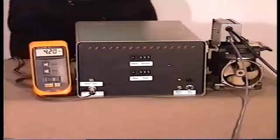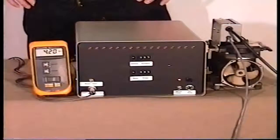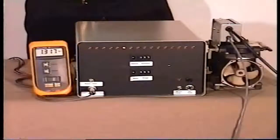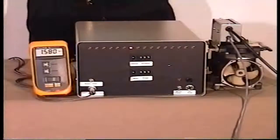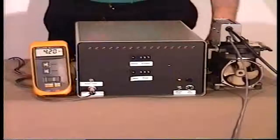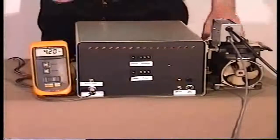The sequencer is also useful in your system if you're dealing with some corrosives. This can go on the back side of an analyzer where your analyzer would continuously measure methane, carbon dioxide, oxygen, and hydrogen if you have a hydrogen sensor. Then you can feed the output of the analyzer into the sequencer and use it to periodically route the output gas through a sensor — say an H2S sensor — collect gas data, then go into purge mode and then sleep mode. It could wake up every 8 to 12 hours or however many hours you set it and collect your data. It would also be good in an algae application where you don't have a lot of gas and can't be constantly pulling it through your analyzer. You can use the sleep mode for this — there's a lot of capabilities with this system.